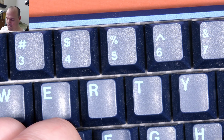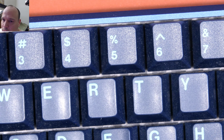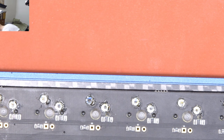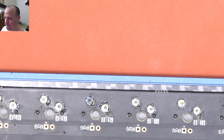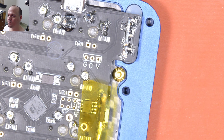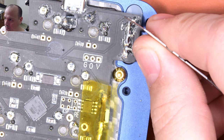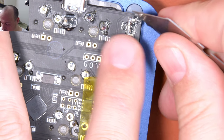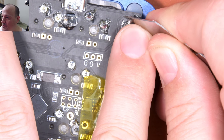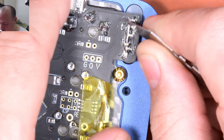Let me just take a quick look at the pinout of the Atmega32U4. I believe E2 is up in the top right corner somewhere. E2 is on the right side and it's the topmost pin. So what I'm going to do is confirm whether that's really the data line I'm looking for — checking if this trace goes to a via that pokes through to the other side of the PCB and leads to the LED on the other side. I should be able to detect continuity between this point and the E2 pin on the microcontroller. I'm going to double check that first.